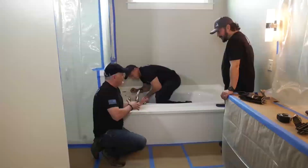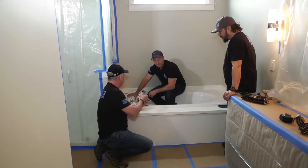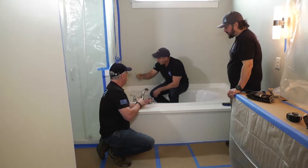Paul gets in — first thing we do is cut some caulking out all the way around. We take the razor knife, run it across the top. You want to get to a corner, pull it off a little bit, and once it pulls off, you run your blade and you cut the caulk. It cuts a lot easier with silicone — just pull it off.